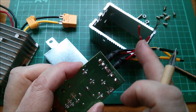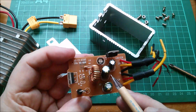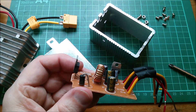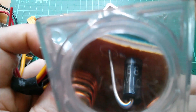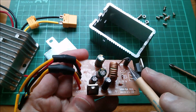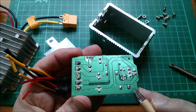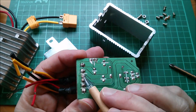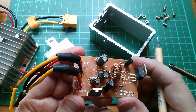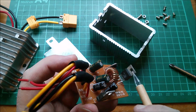So all we have there is a 12 volt linear regulator - an entirely separate circuit. What's left for the switch mode circuit is two tiny resistors, two modest 220 microfarad capacitors, this diode - let's see what that is. It's a 1N5822. That's a 3 amp Schottky diode, with the anode on ground, cathode to the inductor, and the inductor out to the yellow output. It's only rated for 3 amps, so I'm having to downgrade this from 30 amps to 3 amps just based on that diode.